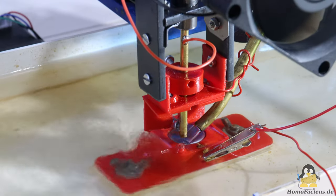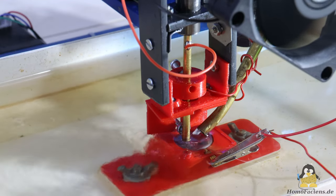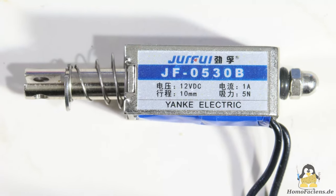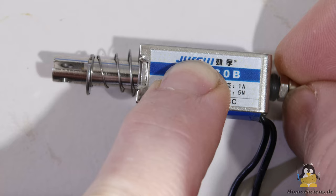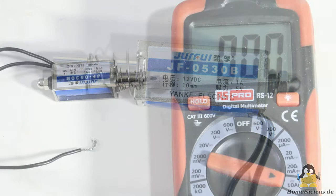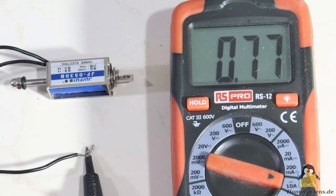In the previous two videos I showed how to use a self-made lifting magnet to engrave metal. To see what commercial lifting magnets are good for, I bought a rather cheap one. Disadvantage number 1, the anchor is anything but free of backlash. Disadvantage number 2, a specified current of 1 amp at 12V turns out to be only 770 milliamps with a falling tendency during operation as the coil wire heats up.